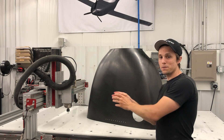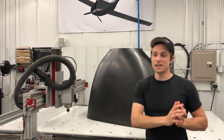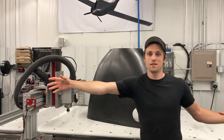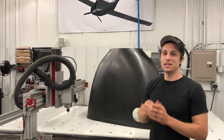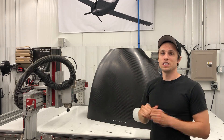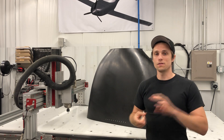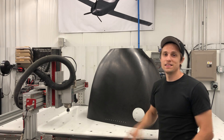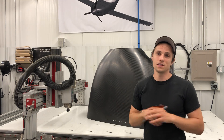This router fit a really good overlap of those three things. If we went smaller, we'd be piecing together a lot of different mold pattern sections to cover the entire aircraft. If we went bigger, we're looking at an order of magnitude higher cost for not much return in terms of accuracy and precision. So this machine fit the sweet spot of cost, machine volume, and accuracy and precision.